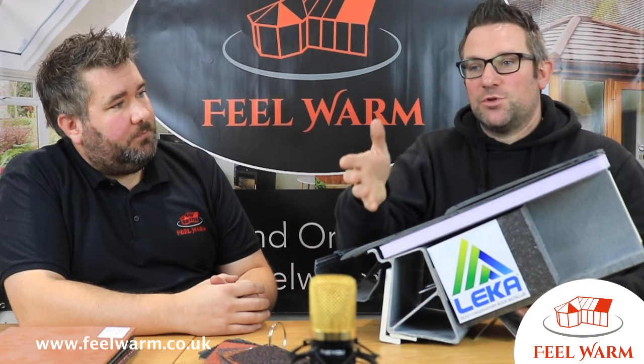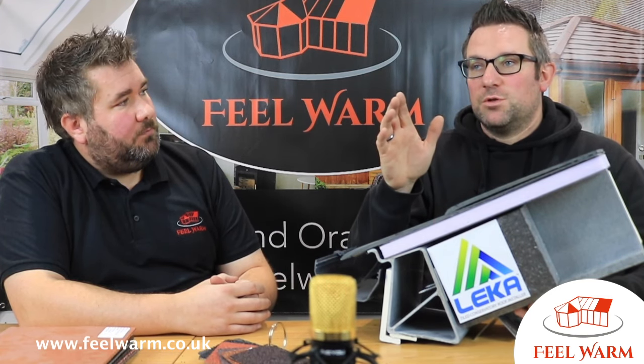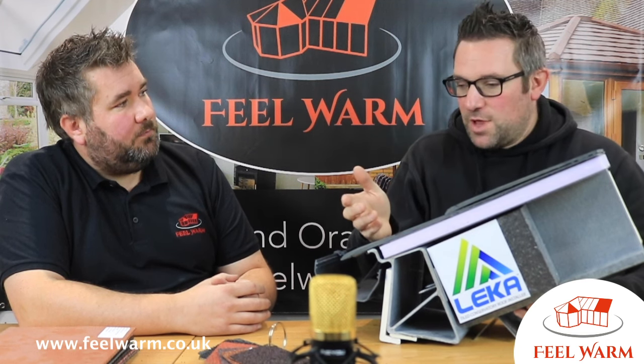Yeah, absolutely. And again, with the overclads, not even touching on the fact that you're screwing into these rafters and all that kind of stuff. There are people who just do the underclads. They don't have anything done on the top. They just have the underclads, insulated and plasterboarded. What happens when all the top caps start to fail?